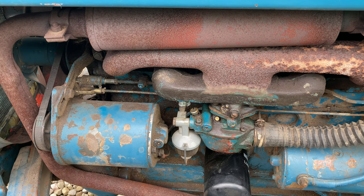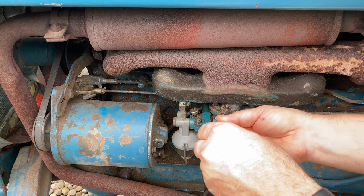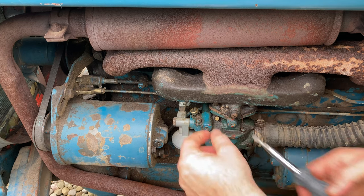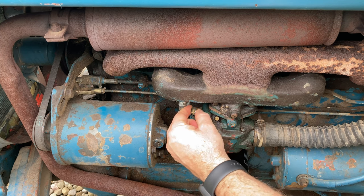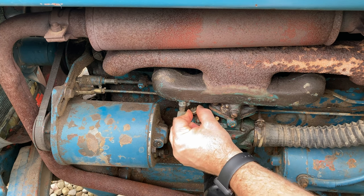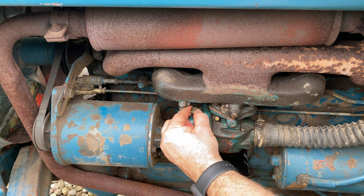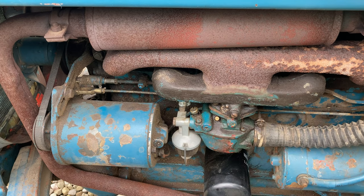And it says in most of the forums that when you're first starting out with your carburetor after a rebuild, your idle screw should be about 1 full turn out, and your main jet screw 1/4, 1/2, 3/4, 2 turns. So it says try it at 2 turns out and 1 turn out to get started.